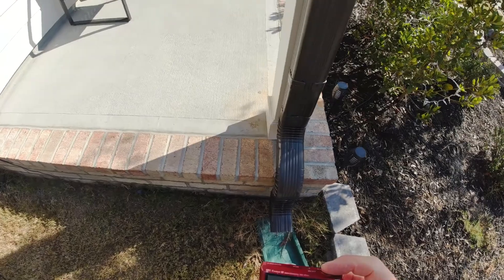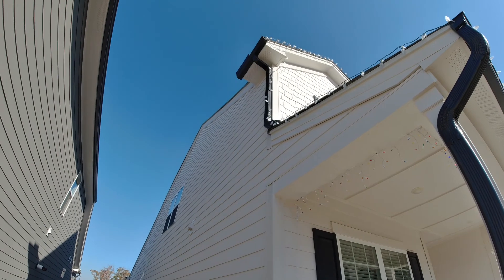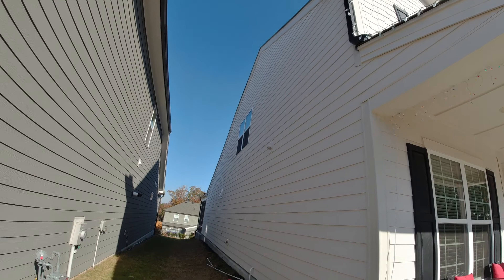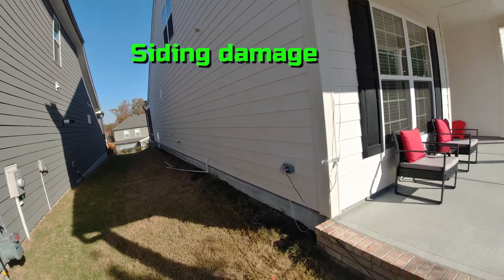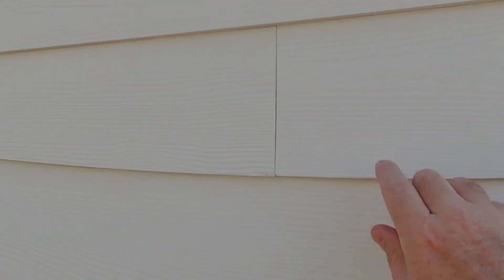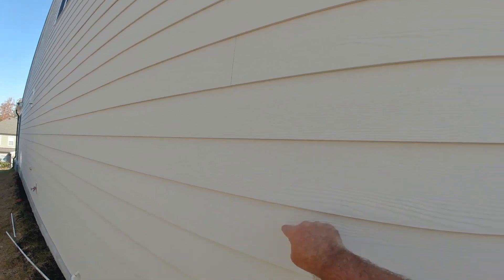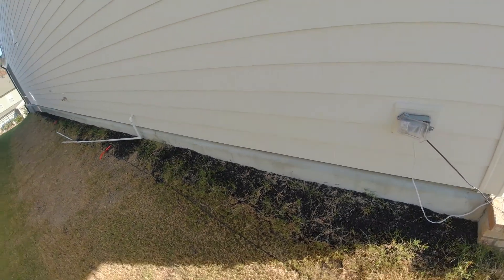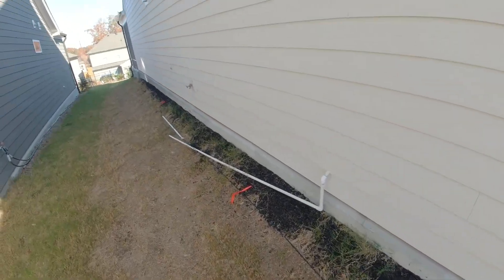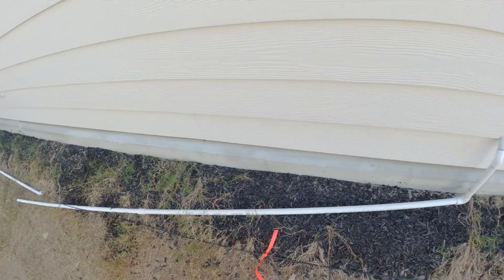Also look for these landscape lights — they can sometimes be broken. So you get your left slope, come over here and look at the gutter downspout. Run your hand up and down; a lot of times you'll feel whether there's damage or not. When there's a spot like this, it's a great area to show some damage. Look up top — the person's lights are probably protecting that section. Check your siding. That ding on the edge looks like somebody hit it with a hammer putting it up. Look down at the foundation foam at the bottom — got one right there, a little ding.